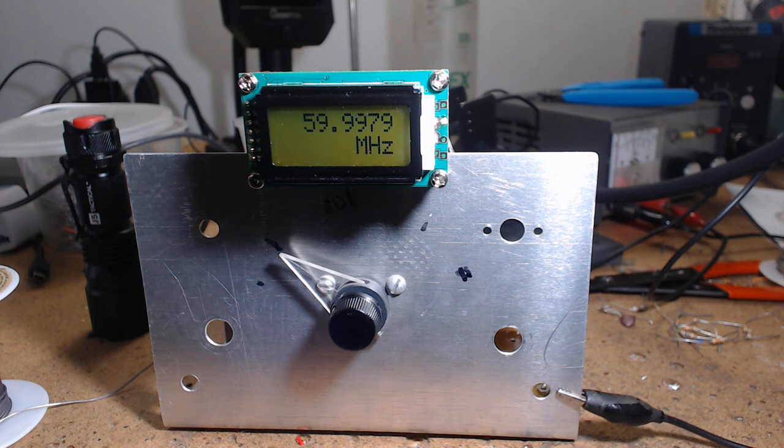I know I've got the huff-and-puff within 100 Hz, which is pretty good — okay for sideband and CW. It does settle down. But what'll kill you is if you have a dual-conversion receiver with a 300 Hz CW filter — if the receiver drifts 500 Hz, that filter will stop passing the tone. You'll be copying the guy and he'll get weaker and weaker, not because he's fading but because your radio is warming up and shifting. That's why a lot of people like the new digital radios with synthesized oscillators, though synthesized receivers have a high noise floor unless you pay a lot of money.